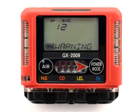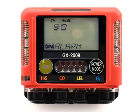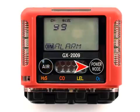To accept the value, press the Power Mode button. The screen will now show the current alarm setpoint for the LEL sensor with the setpoint value flashing. To increase or decrease the numerical value, use the Air button. To accept the value, press the Power Mode button. The screen will return to the percent LEL sensor selection. To advance to the next sensor, press the Air button. The screen will now show the OXY sensor selection. To view or change the oxygen alarm setpoints, press the Power Mode button. To advance to the next sensor, press the Air button.